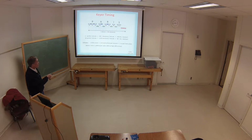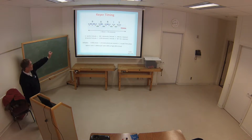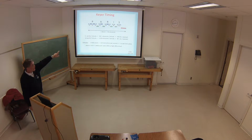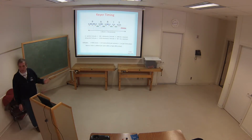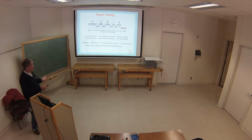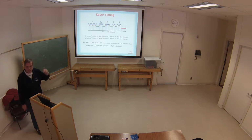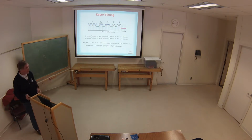So then at 5 words a minute, 250 elements per minute, 240 milliseconds. Each one of those little things has to be 240 milliseconds if you're going 5 words a minute. If you're going 25, then you're down to 48 milliseconds per element, and so on. So with a 16F628 processor, and I run it with a 4 megahertz clock, 4 clocks per instruction, so you get 1 million instructions per second, 1 microsecond per instruction. So it's very easy to go from there and make my timing loops and figure out exactly how many instructions I have to do to get a 200 millisecond element and so on.